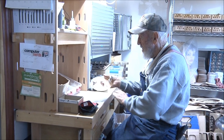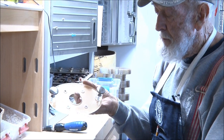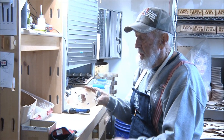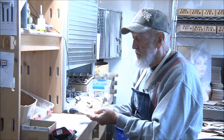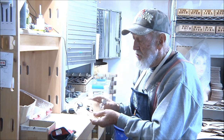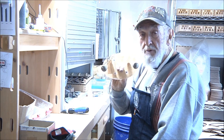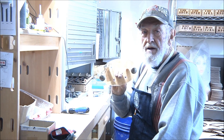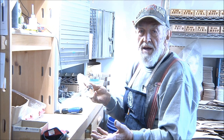There, my friends, you have the completed base plate for the DWP611 DeWalt router or the Porter Cable 450 router — the hole patterns are the same on both. All you need to do is take the old base off, put this on, put the screws in, tighten them up, and you're ready to make a sign. So there you have complete directions and specifics on how I make these router base plates. Hope you enjoyed this — it's been a little bit longer senior moment than some of them, but it's what I do.